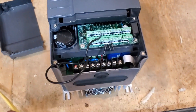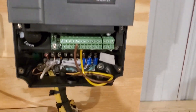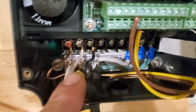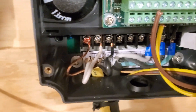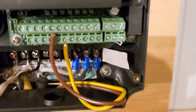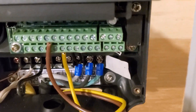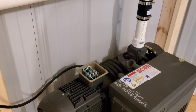So you need to add a thermostat, a wire, or a switch of some sort. I'm going to show you guys how we wired ours together. On the panel, you can see on the left-hand side you have one, two, and three — those are your power wires coming in. One is your ground and two and three are your hots for 220 coming in. On this side it's seven, eight, and nine — those are your three-phase power coming back out and going to the pump.